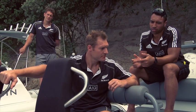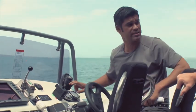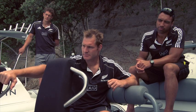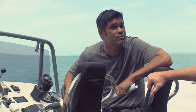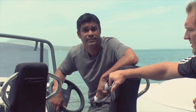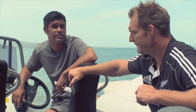Where's the fuel gauge and how far can my Sea Legs go on a single tank? The fuel gauge is up here and is normally part of your outboard gauges. The size of your tank depends on the boat you've got. The 7.7 range have about a 180-litre tank, which will give you four to six hours of driving depending on how fast you drive. The 6.1 meters have an 80-litre tank under the floor, giving you two to four hours of running.